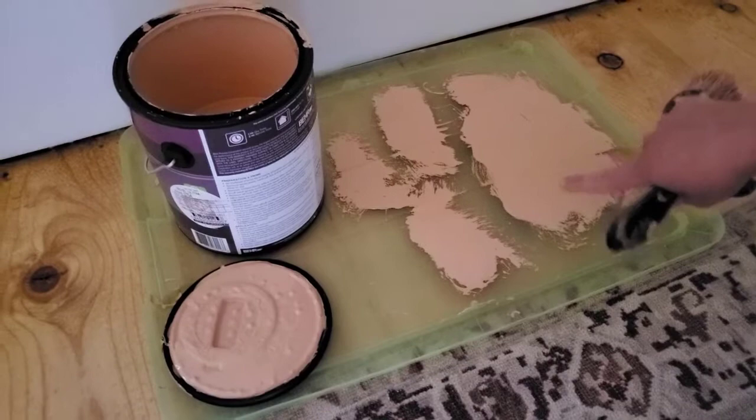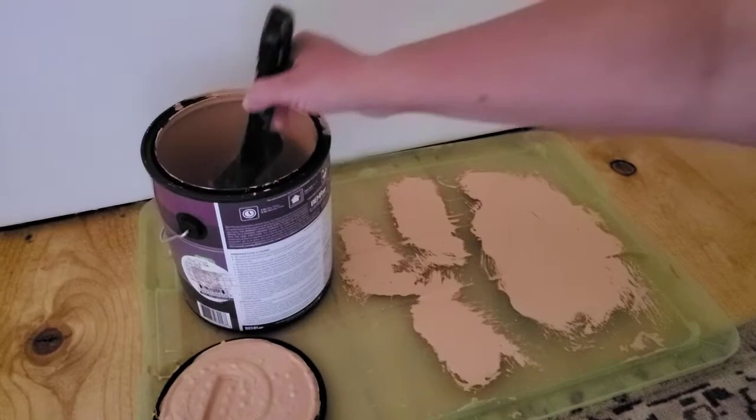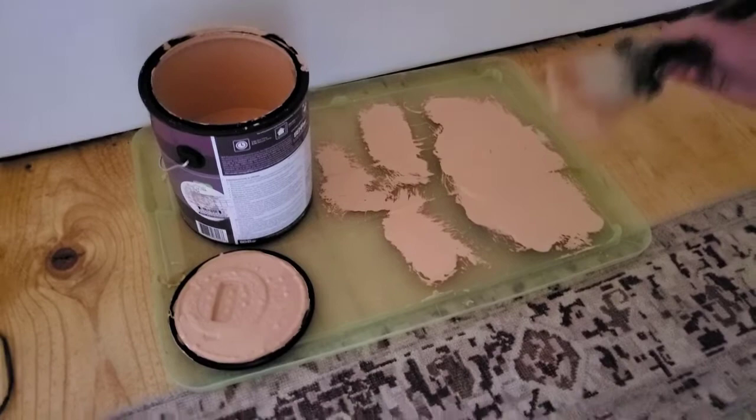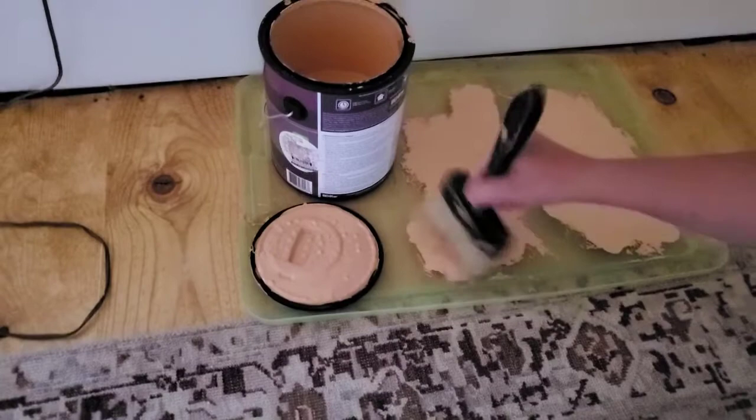Probably the most important trick is you want to have the least amount of paint on your paintbrush as possible. So I dip my paintbrush into the can and put some in a pile on the side, and that's where I would always dip from. Then I would brush off as much of the paint as I could — it also works to put it on a towel — but you want very little paint on your brush.